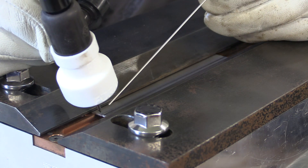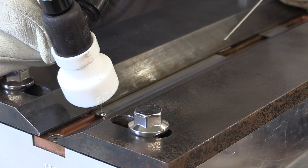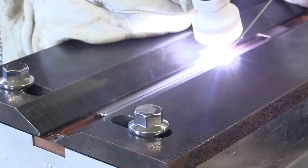I've got the piece locked down in the fixture — time to get a tack on each end. It's nice to have a low amp start; this machine starts at 5 amps, which is really nice for these end tacks. On the next tack you might notice I add just a little extra drop of filler metal — I get it joined together and then add just a little bit extra, and that gives me a little leeway.